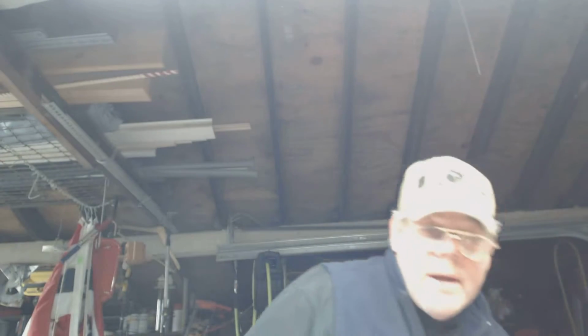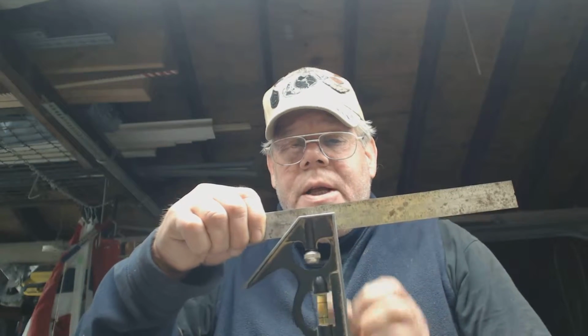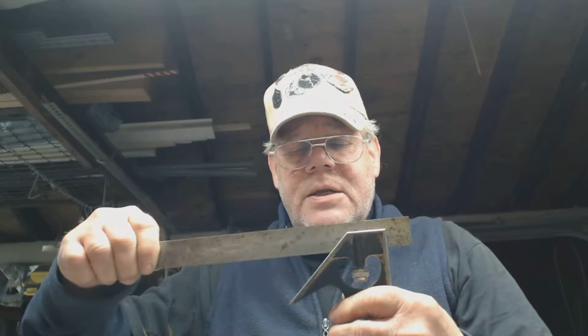Now, the other combination squares that I showed you, all of these other ones, I'm just going to put them all aside because I showed you how to do the first one, right? Oh, and by the way, if you have a combination square that is out of square, you can put it into square. All you got to do is loosen the blade. Now, a lot of people will tell you to use, like a needle sander and sand the inside out. Loosen this guy here, the nut that makes the ruler slide across it. Take it out.